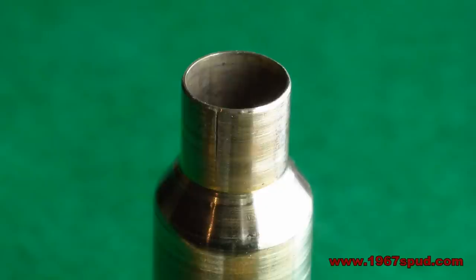This is a classic sign of a hydraulic dent, caused by over-lubrication at sizing. When you size with too much lubricant in there, all that pressure has got to go somewhere and it creates a hydraulic dent as you can see here. This case is once again totally unusable. If you were to use it you would have catastrophic failure and you would be putting your gun and yourself at great danger.